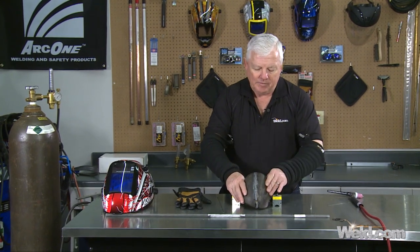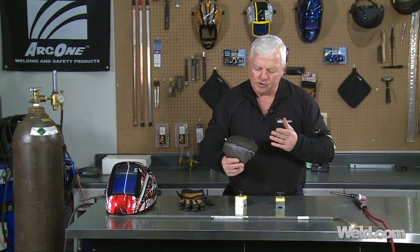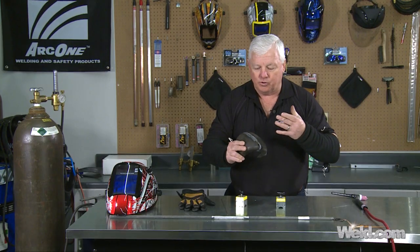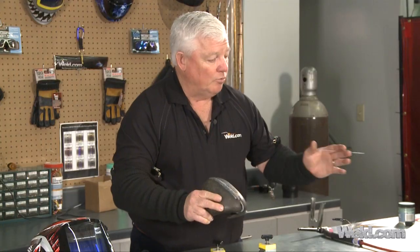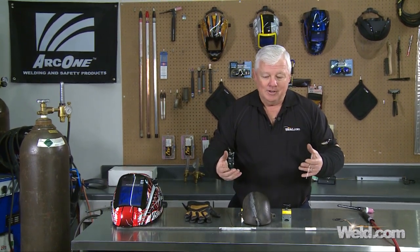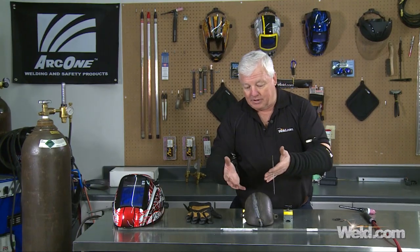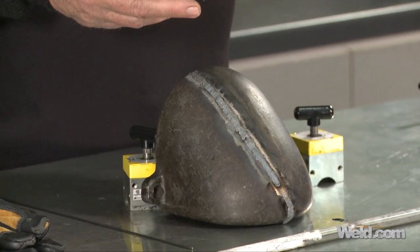Cast is so difficult anyway. I don't like to put cast projects into life safety items, so make sure you've tested it and your welds look good before you do anything with it. This is the first cast iron I've welded with this filler material, so it really was a live test. You've got to imagine the manufacturer is putting himself at risk by saying 'hey, try it' — we're basically live, guys, there are no cuts to this. It passes our initial test. We're going to do some more cast, but you need to know that this worked pretty good.